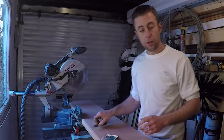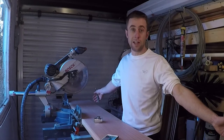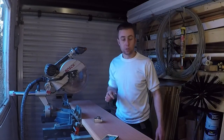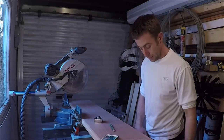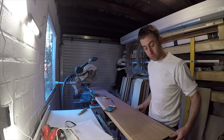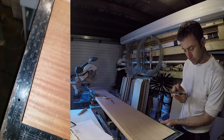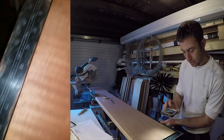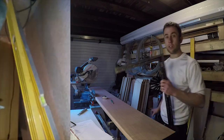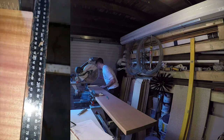The first thing to do is when you get the bit of wood, it'll be cut either end, obviously, because it comes in length. If you look at the ends, you'll notice they're probably not square. So the other bit of kit you'll need is a good size set square. I'm just checking the squareness of this. You can see how that's not quite square. It's got a bit of a gap down at this lower end, and less of a gap, and it's touching up there. Just going down to the other end, we check that. Okay, well that looks much better.